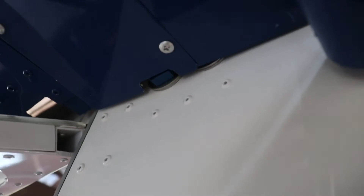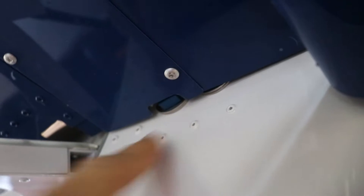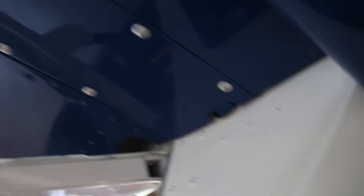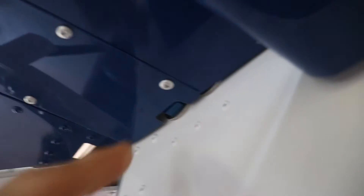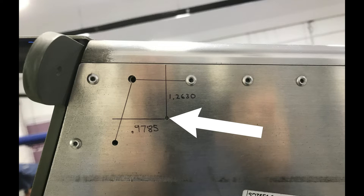You can see on my cruiser, this is the nut that's on that fitting, and it sticks out just a hair below the bottom of the wing. I just notched out — this is actually an access plate on the bottom of the wing. So you want this as high as you can, but if you go too low, it'll stick out the bottom. This pilot hole right here is the hole that I drilled for that elbow fitting.